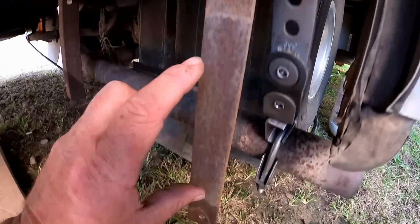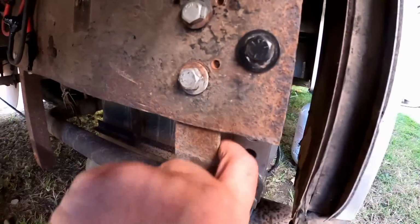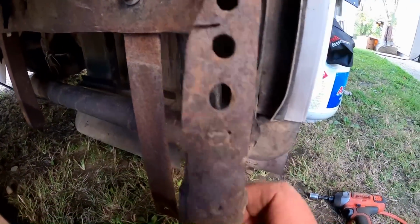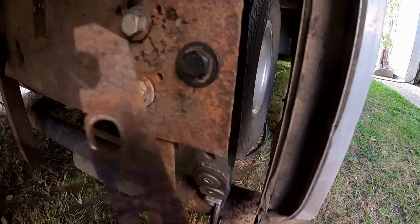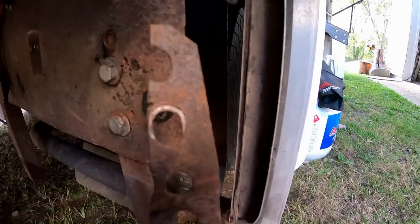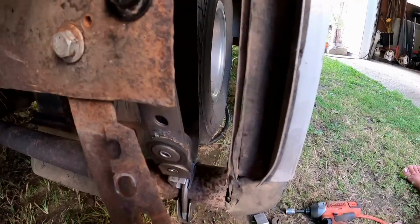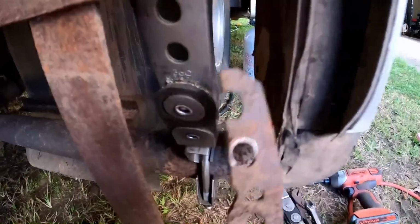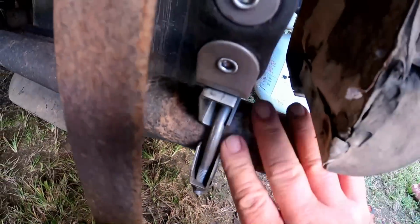So anyway, this angle's been lowered, and the way they had that kind of sistered in on the inside of this angle, I'll show you what they did here. Okay, that's the way it's supposed to be. Up here they kind of hacked it up, it's an inside corner, so I had to kind of do a nice little modification, but I chose to just get it out of that angle altogether, put it out here on this plate with its own hole. It's on a flat surface. I didn't have to hack into the hanger to do that. All nice and straight down there, all nice and secured.